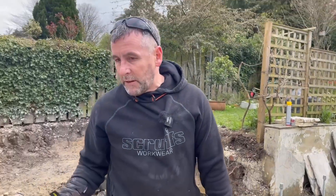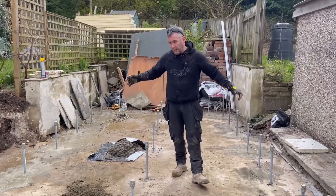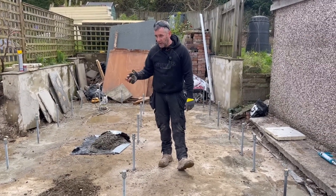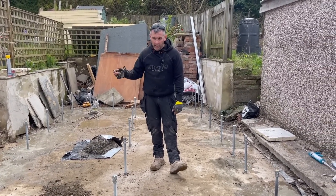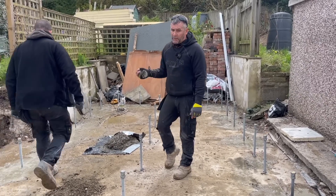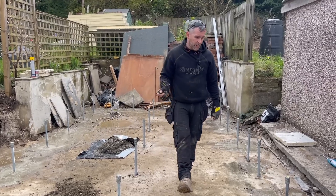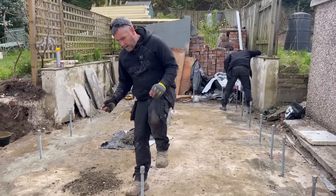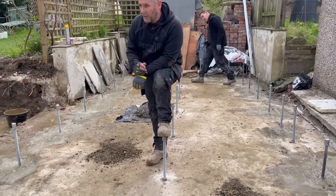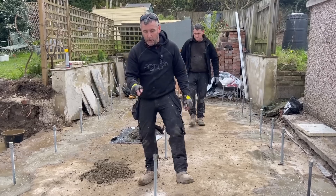In this particular instance, if you wanted a concrete base you'd have to dig all this out because it wasn't sufficiently strong enough. You'd have to re-stone it, insulate it, and rebar it - a lot of work and a lot of money. Ground screws wouldn't have stood a chance on this particular job - they'd have turned their nose up and not done it. But the rod system yet again has come good - if you can't get them in, you resin them in.